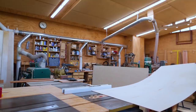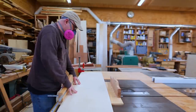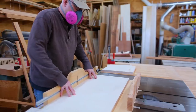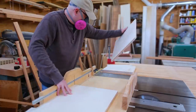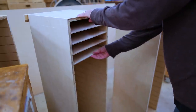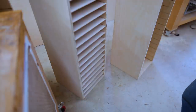I started early on, just after I made the first box, by making a set of the drawer bottoms. The drawers will work by sitting on a quarter-inch piece of plywood that will run in the slots that I've cut in the sides of the boxes. I made a set of these drawer bottoms and tested if they would slide in the slots well, and they seemed to be okay.